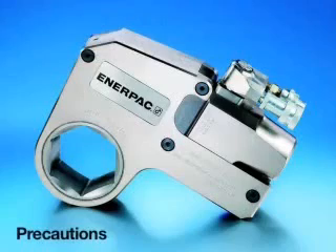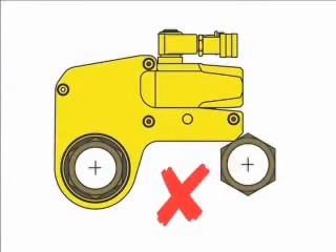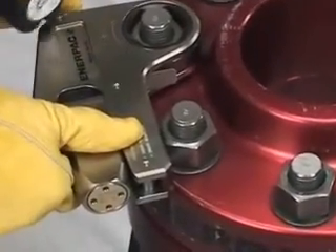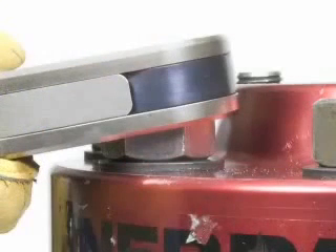Safe handling of the W-Wrench — some do's and don'ts. This is how to properly locate the W-Wrench using the reaction arm. If the reaction arm is placed incorrectly, it may actually damage the nut or the wrench. Incorrect placement can also occur if the nut is too close to the wrench and the reaction arm cannot be positioned properly. Be aware of pinch points from the reaction foot — the reaction foot can pinch your fingers or the hose if you are not careful. Correct use and location of the W-Wrench is shown here. Make sure the W-Wrench is balanced as in this view. Incorrect use occurs if the W-Wrench is placed improperly on the nut and associated surface.